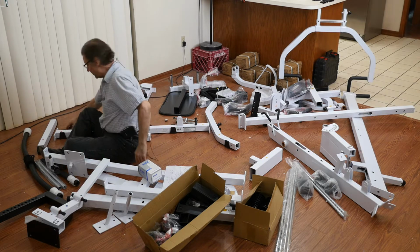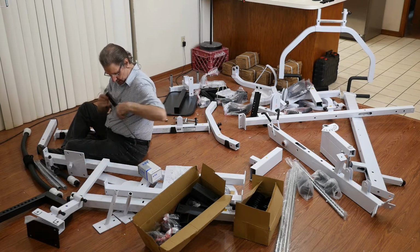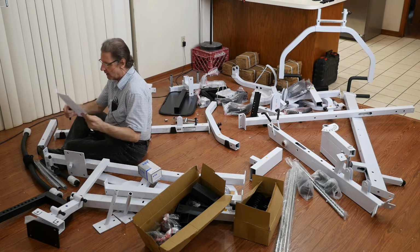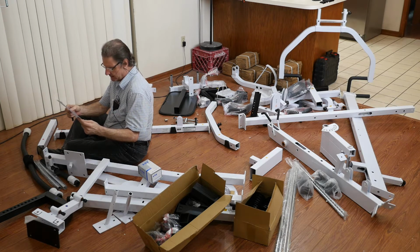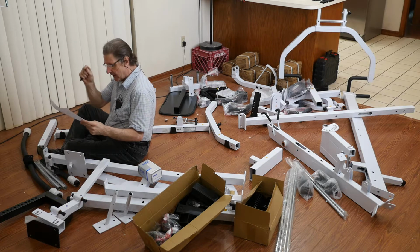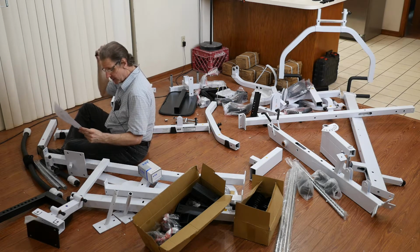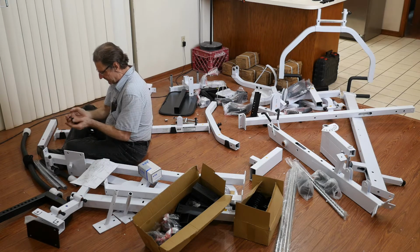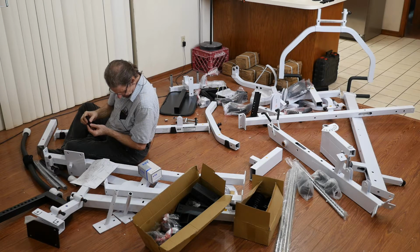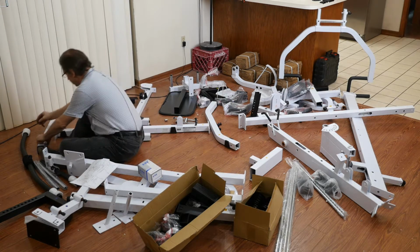And then this is what's tricky. They only showed one bolt. When the... there goes my microphone. Am I still getting signal? Yeah. Let me see. This is a short one. This is a 3-inch. And remember, there's 3-inch, and then where they piggyback two metal plates for an upright, that's 3 1/4. So you've got to actually measure. Make sure you've got the right one. It shows the washer is on the head of the bolt. It comes from the outside, and they're only doing this one.